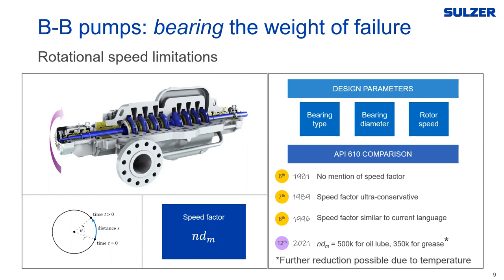In practice, we don't use this equation to make decisions directly. This is something that goes into the design of the equipment. We use this type of equation to make judgments on what size bearing housing is best suited for a given pump range or model, and we've kind of predetermined that. So on your end you won't see it — it's already in our product catalog that we've sized the bearing to the pump. Then we can make small adjustments based on extreme conditions or other factors.